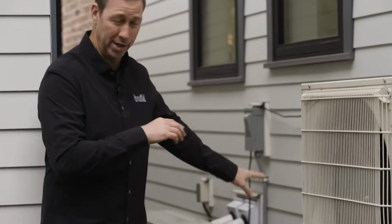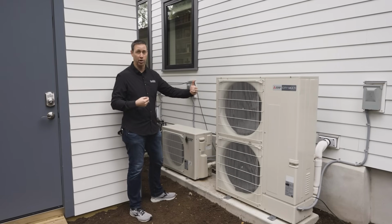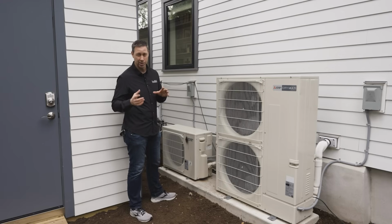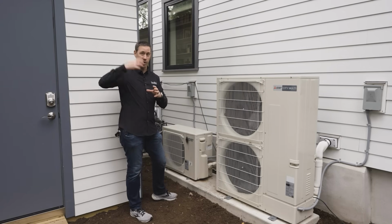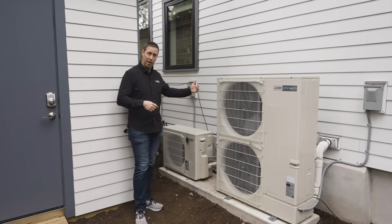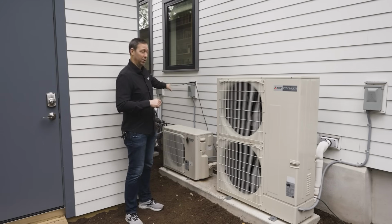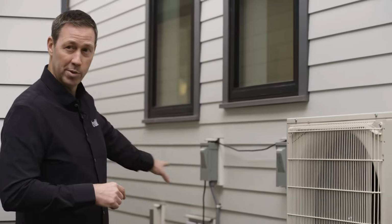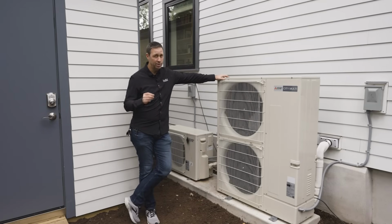And then beyond me, it's a little tight in here with my shed that I built, but I've got my Sanden CO2 split heat pump water heater. Kind of a unique system. It's one of the only ones I know of in the market that has an outdoor unit that makes the hot water from ambient temperature, which makes a lot of sense in the South. And then there's a set of Uponor pipes that come out of the building, 2 of them. And that's where I used another type of Airex boot. Those happen to be the TGS Airex boots. So each one of those is holding one water line in and out. And again, I wrap those in pipe insulation. Now I did put heat tape in there though, just to be safe.